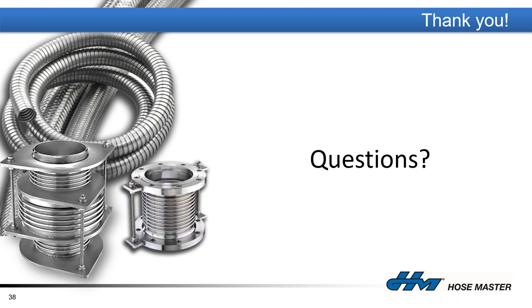Question: Are there rules of thumb for how short a hose assembly can be? The three-times-ID rule applies to expansion joints, but for metal hose it's harder to generalize. You can consult Peerless or HoseMaster — we have a defined length for normal vibration that differs for every diameter because convolutions per inch change with diameter. If a hose is short enough, you're essentially installing a piece of pipe, because there aren't enough convolutions to accept any movement.